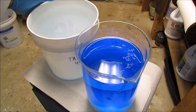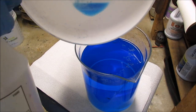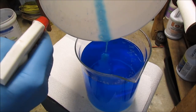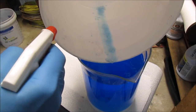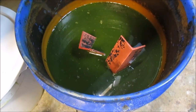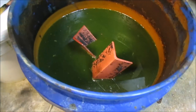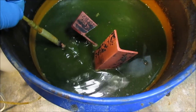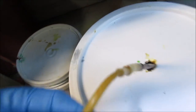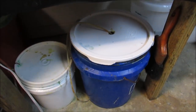This is the silver chloride that came from the waste bucket — I'm going to rinse it out and add it to my silver chloride jar that I save up. When I get enough of it I process it into pure silver through my silver cell. There's not very much here but it's worth saving. The copper has already started to cement out onto the iron pieces. I've got a bubbler that I stick in the waste bucket and bubble air through to keep movement going. I put the lid on, put the bubbler through the center hole, and stick it back under the fume hood — that's how we get the copper out of solution and treat the waste.